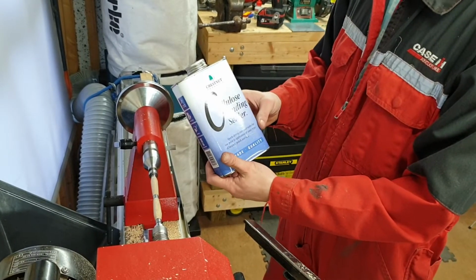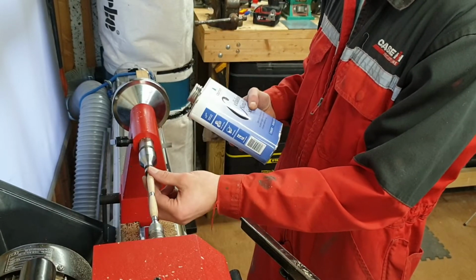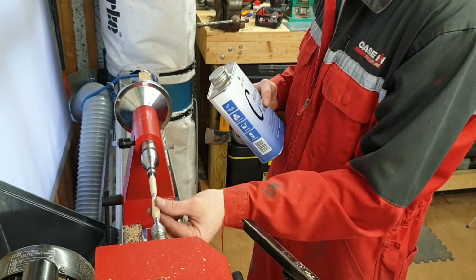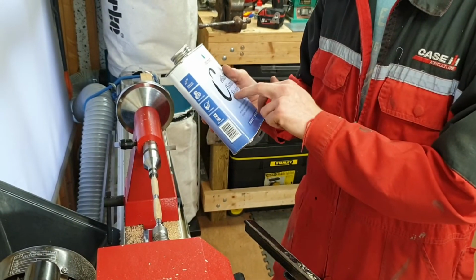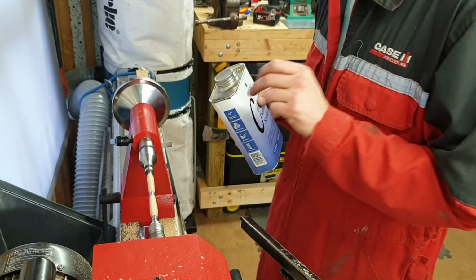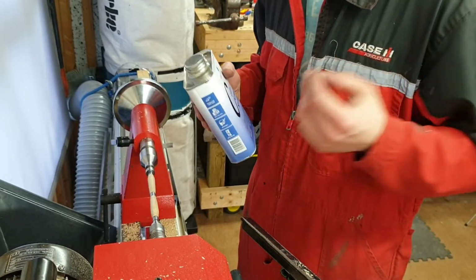cellulose sanding sealer. So this will go into the wood, fill it in, make it hard, and it'll make for a good finish, a good sanding process afterwards, where I get it really, really fine and then be able to buff it up. So that is apparently, at this stage, this is when you apply the sanding sealer. So I'm going to skip through that part and we'll get back to you once I've done it, because you're supposed to leave this to dry for 10-15 minutes, so we haven't got time for that.